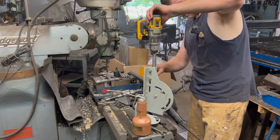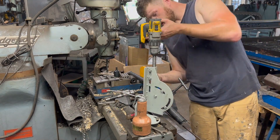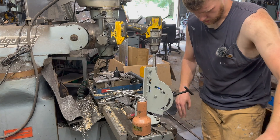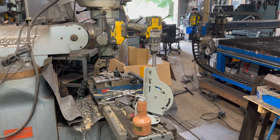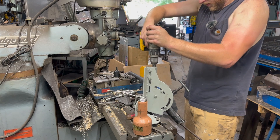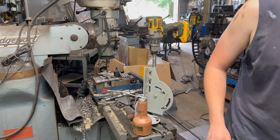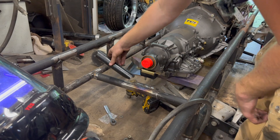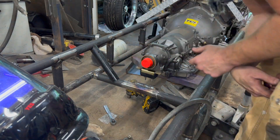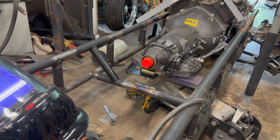One bad thing about this Harbor Freight tube notcher — I guess it's not just Harbor Freight — but I'm going to have to take it out sometimes on angles because the hole saws aren't deep enough. I need deeper hole saws. Let me cut this off, I think we can still get through that. Let's try this again — let's see if that fits or not. If so we've got to make one more of them. I need a rag. Back over here we go — let's see if this fits. Oh, that's a beautiful thing right there. Make one more of those, identical to that — I won't bore you guys with that.